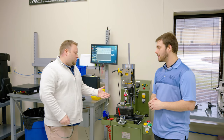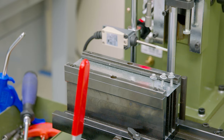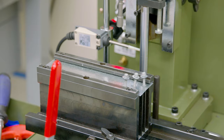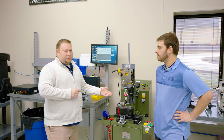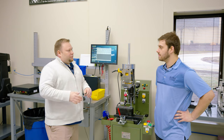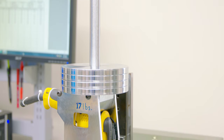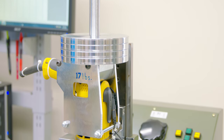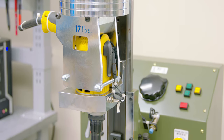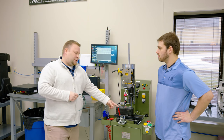This is a test machine we use to test the speed at which our screws drill and pierce metal, or sometimes wood. It really helps us differentiate between the standard and what we're manufacturing — we always want to be better than standard and better than everybody else. Drill speed is important because you're only going to get some speed with certain drill guns, so you want to replicate that speed if possible. Sometimes a faster speed will help you pierce a little faster, but a lot of times if you can slow that down it helps with the cutting of the material.